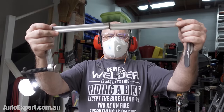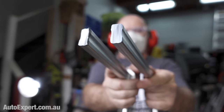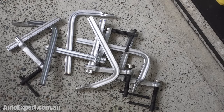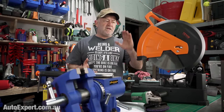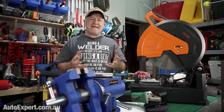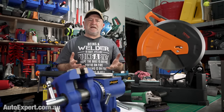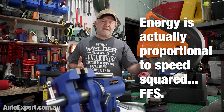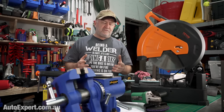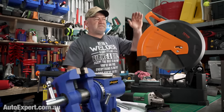You do have to wear breathing protection with abrasives, and they do work really fast. The abrasive cut-off saw is about the same diameter as this TCT saw, but it rotates at 3600 RPM versus 1200 RPM on the TCT saw. From the point of view of mayhem it can release, the TCT saw is much safer — it's not going as fast, energy is proportional to speed, and the TCT blade is much more robust than an abrasive disc.